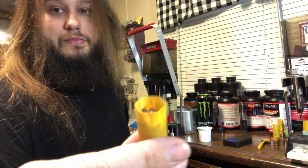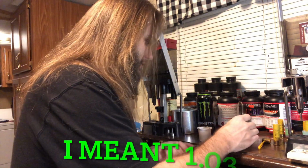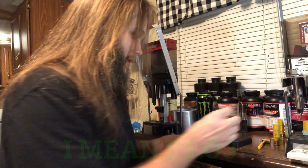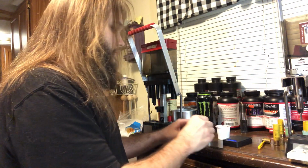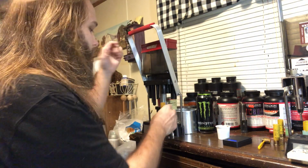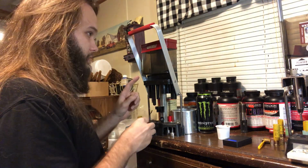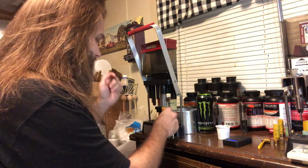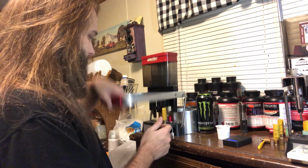Actually overshot it. But see, an ounce comes up right to where it needs to be. That was 1.3 ounces. It's still 1.1. Back that off a little bit. We now have 1 ounce. It's still right where we need it to be too. Using this is a 6-point, so front station. I can't remember what it is. Yep, it's the front station. You want the valley of the crimp facing you.